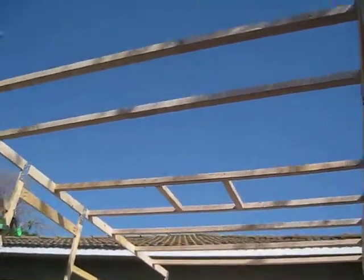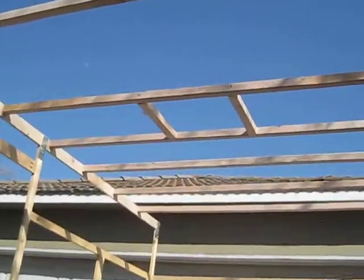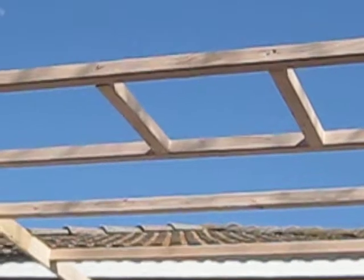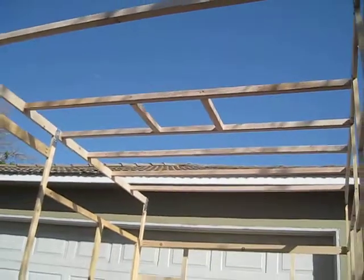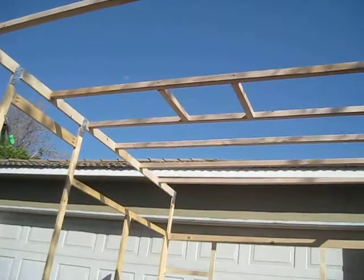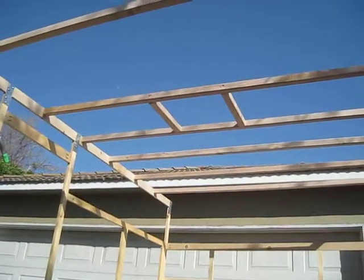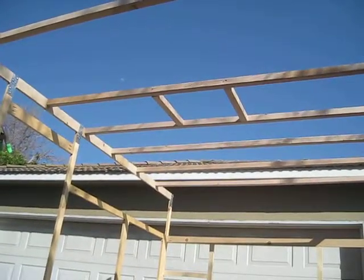There's the very front, and this one right here in the middle is going to be where our vent is. That's a 14.5x14.5 square — that's our rough opening. Once you put the vent in, it's going to have a little trim piece with an overlap of maybe an inch and a half, and then you'll secure that and caulk it and you're good to go.